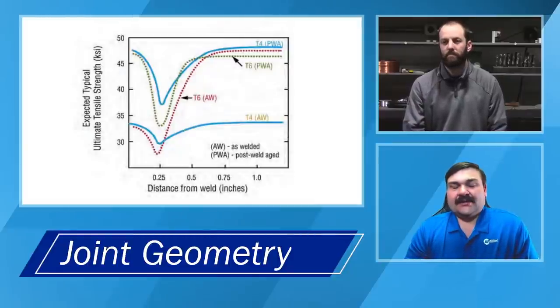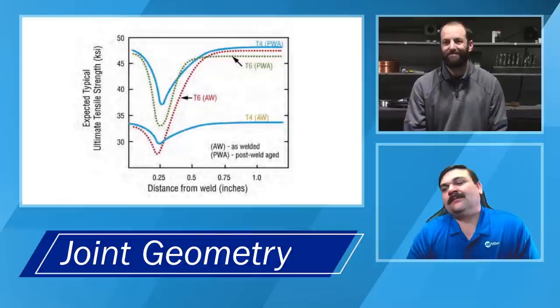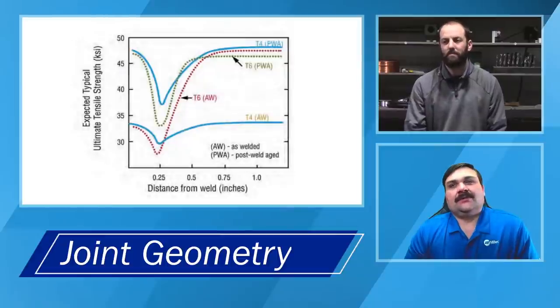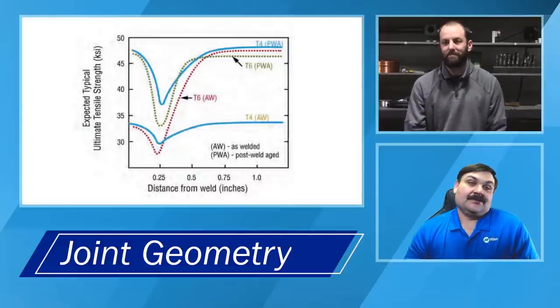With that, a lot of the times it's going to be the nature of the beast. If I take a transmission housing that's been living its life buried in grease versus a brand new aluminum coupon, or cast in general versus a brand new coupon or extrusion, it's never going to weld that great. A lot of times that contamination is so deep into the material that you end up doing a weld it, clean it, grind it, weld it, clean it, grind it type of cycle until you really boil a lot of that material out. And a lot of times you might not even get it all out. It's just the nature of the cast.